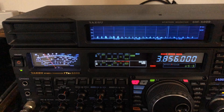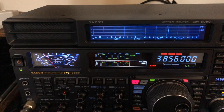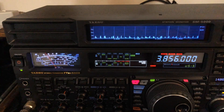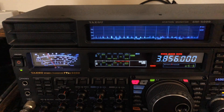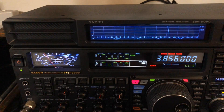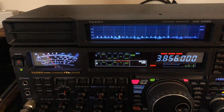Now those of you with an FTDX 10 or 101, you do have those three levels of attenuation. But again, the first thing you want to do is if you've got the noise blanker on because you have no other choice and you're getting that gargling effect — a little distortion in the audio — just be sure to run that noise blanker only as high as you need to deal with the noise.